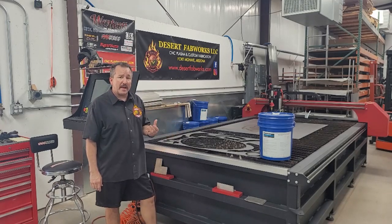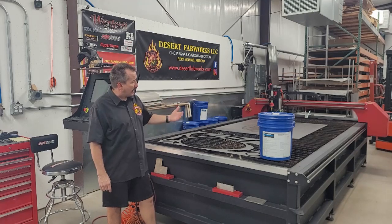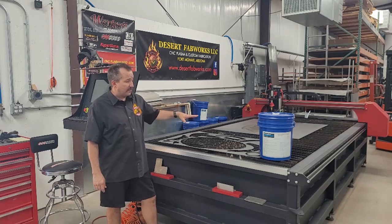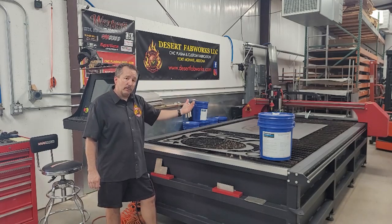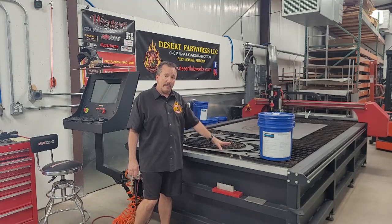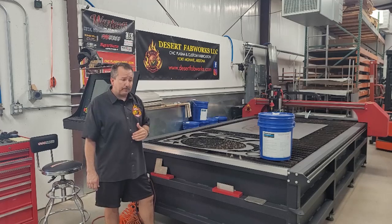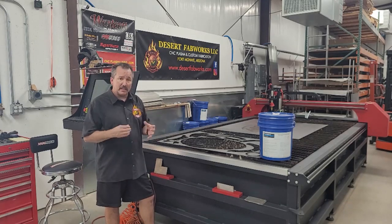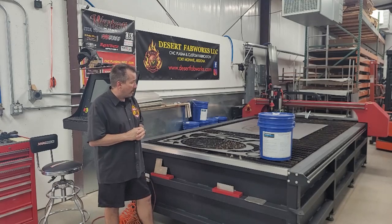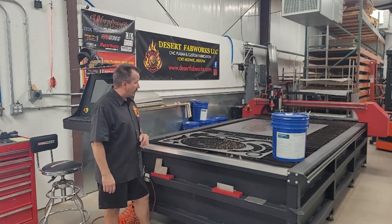With the bladder design, when I stop cutting for the day I let everything sit for a few hours to let the particles in the liquid settle to the bottom of the table, then drain slowly back into the bladder. This leaves the contaminants and cutting remnants behind, really extending the life of my Sterling Cool. When I fill the table back up in the morning, the liquid is clear — you can still see through it, not saturated with debris. This table was just cleaned out a few days ago after cutting some badges.